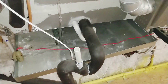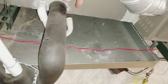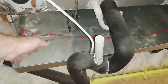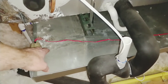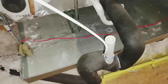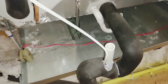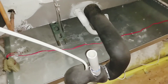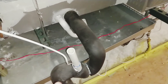If the drain line gets clogged, it'll back up into the AC and come out the other drain hole, which goes into the drip pan. I have a sensor that will shut off my AC if it detects water in the bottom of the drip pan. But some houses don't have that sensor, so the AC might still run even though the drain line is clogged and backing up.